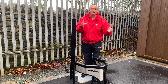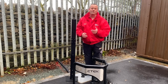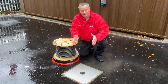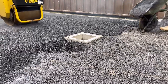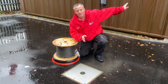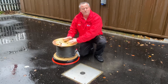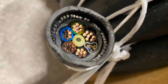It's not going to float in thin air, so we're going to need to support it. We've got this post here provided by EV Tower. For reversing EV cars we need to protect against those, and we've got this barrier here that we're also going to see being installed. At the front of our car park area we've installed a second EV block — for future proofing, but also when we remove the plate there are four access points so we can use it as a draw-in point from our mains end. We've installed our post and our EV charging point, and the next thing is the cable: we're using 16mm 5-core EV Ultra cable from Doncaster, new to the market.